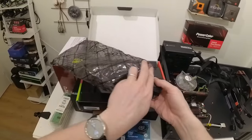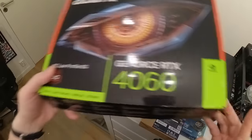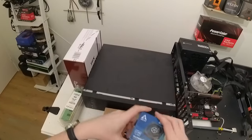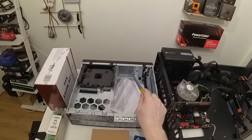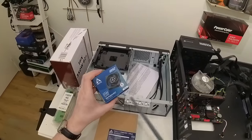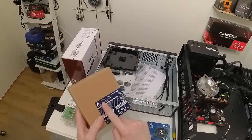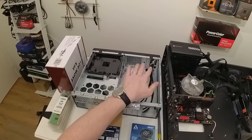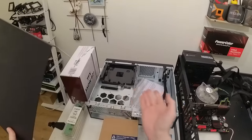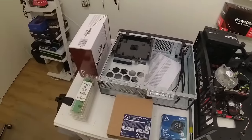I'm not sure how good it will be at staying within operational temperatures in that tiny chassis, but I hope it will be just fine. For the chassis I have a PWM-controlled Arctic fan for the 80mm slot. With the Chinese motherboard we can only control PWM fans, so I had to buy this one. I also have a couple of Noctua fans but they are 3-pin, and some slim fans I hope to install after drilling holes in the top side, because without extra fans the ventilation will be absolutely horrendous and the E5 2667v4 with RTX 4060 will overheat.